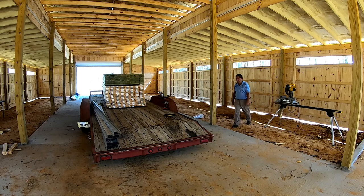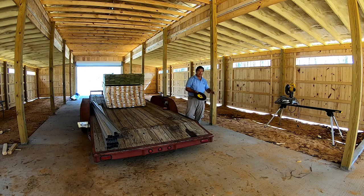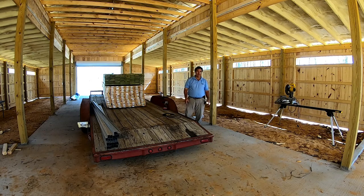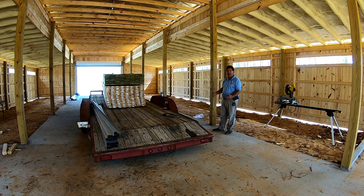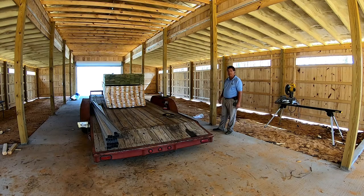So I have a metal cutting blade to go with my chop saw that I'll cut the channel with. I have a wood blade for my chop saw that I'll cut the wood with. My plan is, I'll start on the far end down there and do one of those complete and see how I like it. That way I might make some adjustments, and then after that, when I see exactly how I want it to go, I'll probably cut all my channel and have it ready and screw all the channel up. Then cut the wood. That way I don't have to keep changing my blade back.